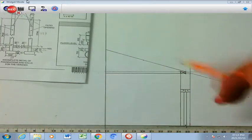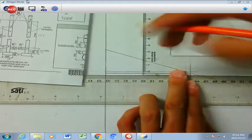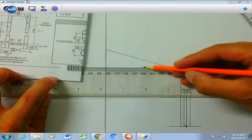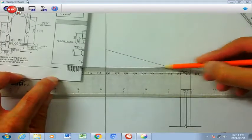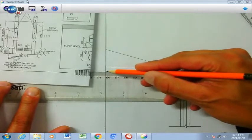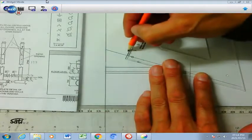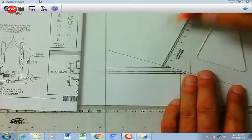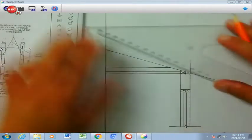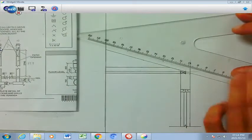That line is going to be for my overhang. I must inflate it — that piece of wood is going to be 6 millimeters, which is the standard measurement you are going to use. So there's my 6. I'm drawing my first part in, which is my tie beam, and I'm going to darken that tie beam immediately. Then I'm going to do another 6 along the rafter — 6 here and 6 over here — and then draw a line that forms my rafter.